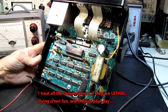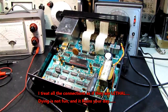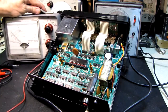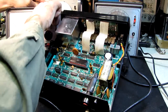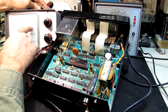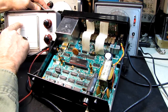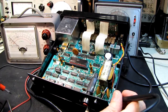I'm going to stay away from that switch at the top and stay away from the 120 volt area. I'm going to take one of the meters we got at the flea market — back up and running correctly and calibrated — and check for five volts. We're going to go times ten because we have a zero-to-one scale on times one. That would be one volt; on times ten, full scale will be ten volts, so five volts will be where it says 0.5.